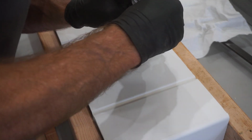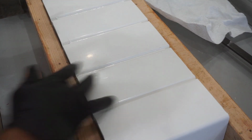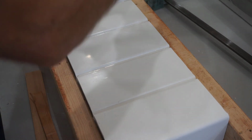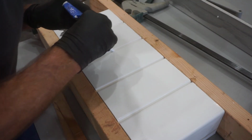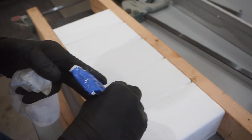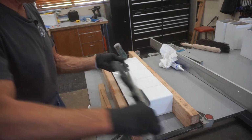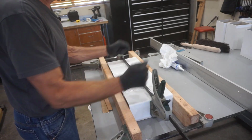You'll have to switch the long compression clamp during this step so that you can get a nice even bead of adhesive on the seams between the compartments. Clean up any excess quickly while the glue is still wet for a neater overall finish. I got a little spooging on that one, but I'll just get it cleaned up quickly and pretend nobody noticed. That just shows it's a good idea to clean off the tube tip and be careful with how much you squeeze the tube while applying this bead of adhesive. And there, after the 10th seam, it looks like I'm finally getting the hang of this. And then just make sure to put that clamp back in place while the glue finishes curing.